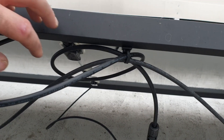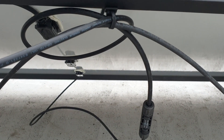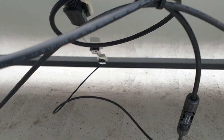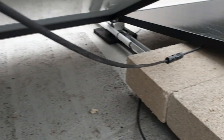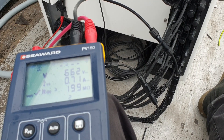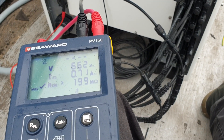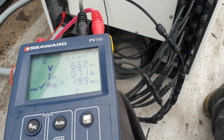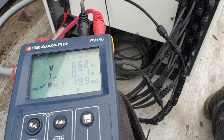You can see how this has happened — it just comes out of this connection block, around this cable, around this cable, back through to itself into the one down the bottom. The things I normally check on a commissioning — that all the cables are tied up — they've done beautifully. It's just this one isn't connected to the string it should be. It's now raining, but we've got sensible readings for this string now. The other one was reading 667V but it was marginally less cloudy earlier, so all good.